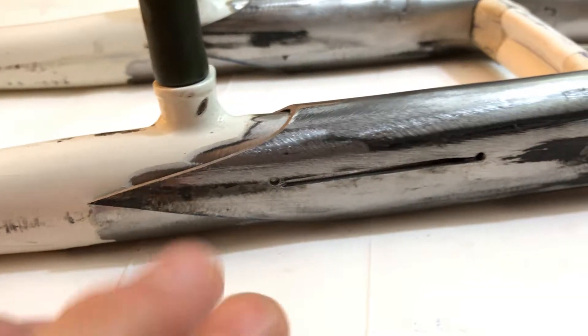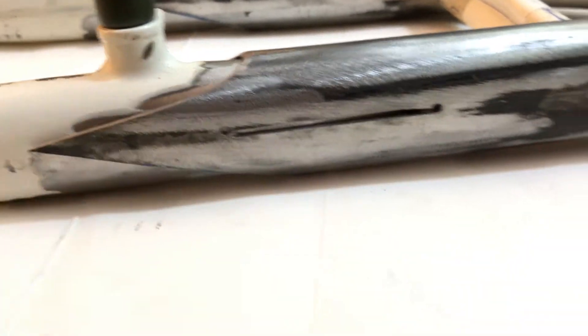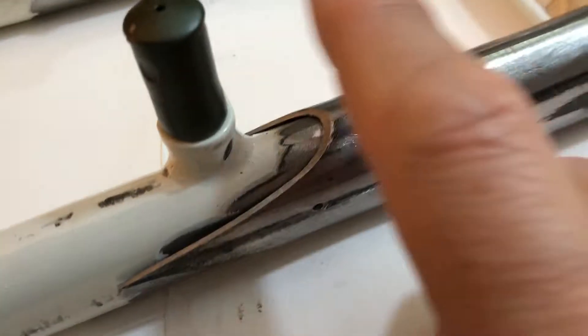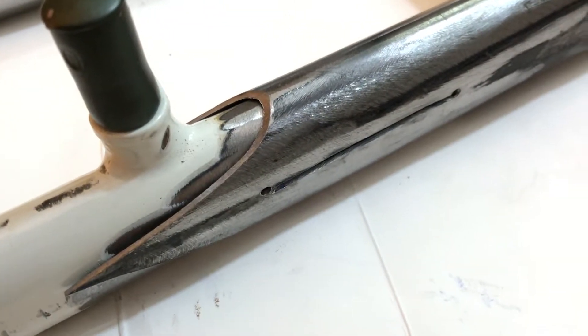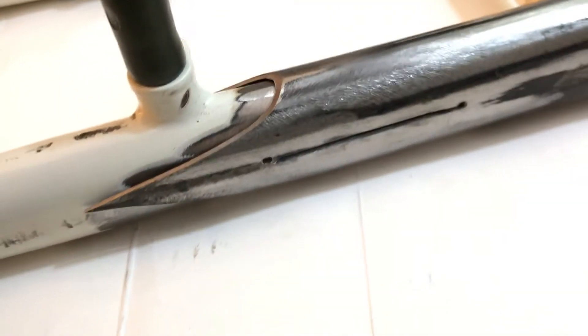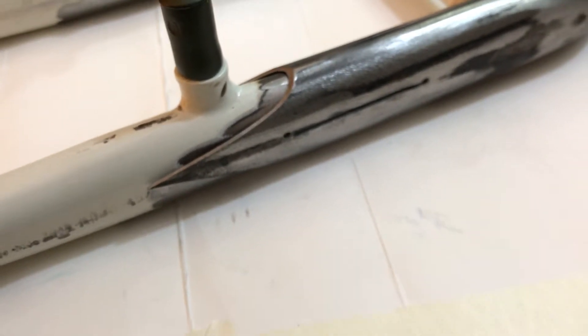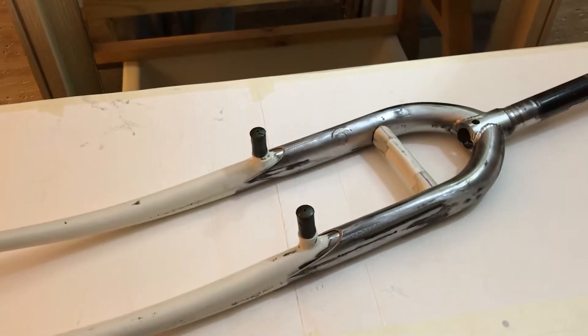Then I cut some slots and drilled some holes from the outside so that I can penetrate and basically melt the two metals together nicely. After it's welded, I can just hammer it closer to the steel where it's not quite tight, and then I will braze that. So that will be the first time I've done brazing — I ordered a kit on the internet. It'll be my super fork.